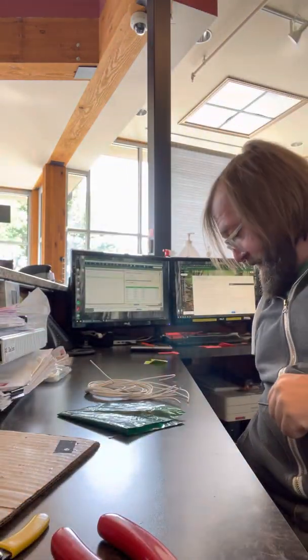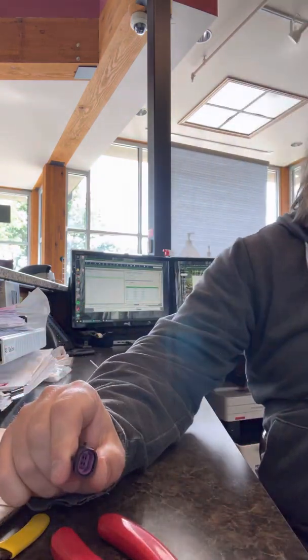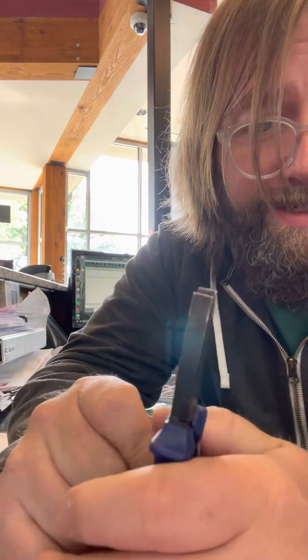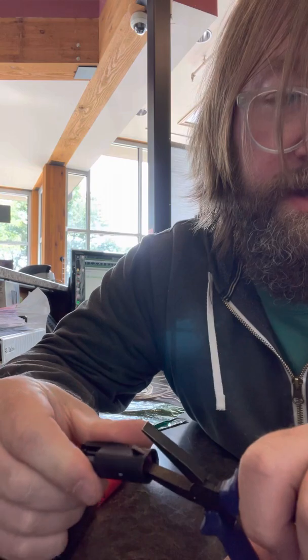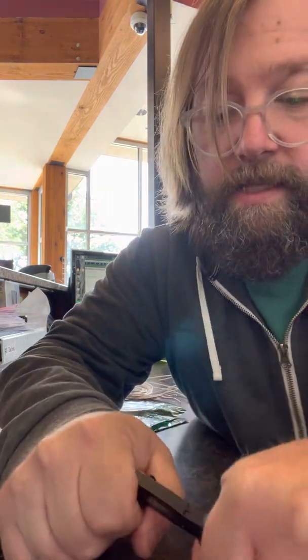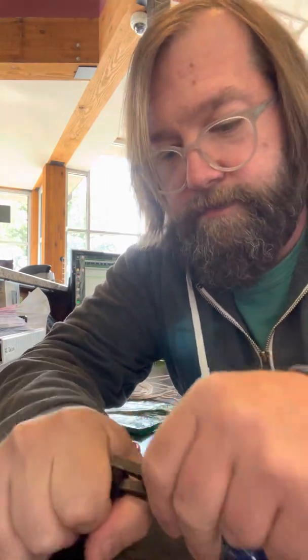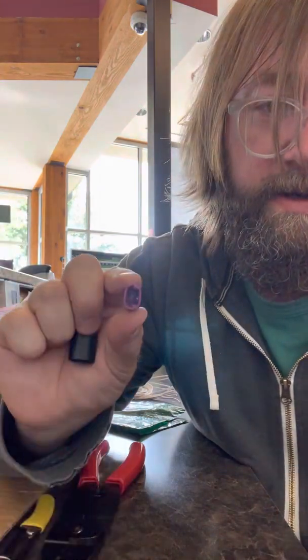So that's in there. Now my other trick to remove that lock, in my opinion, is I've always used these, or you can use like a flat nose screwdriver, but I use these like duckbill style pliers. And as I'm inserting it in there, I kind of give it a twist and a pull, and usually they pop right out, but because I'm on film, it probably won't come right out. There we go. Pops right out of there.